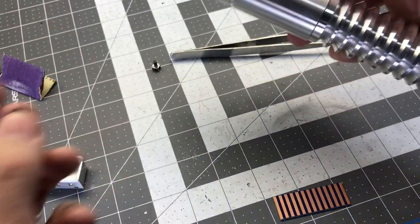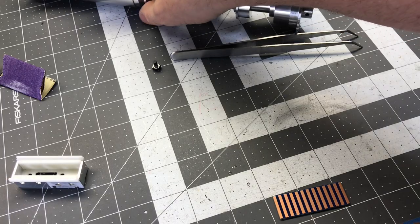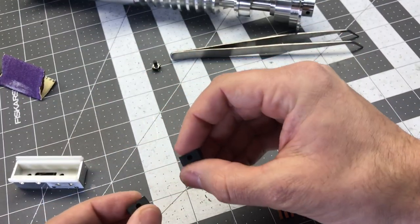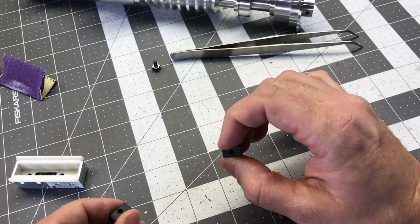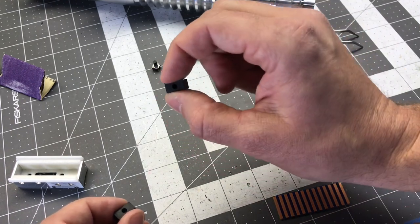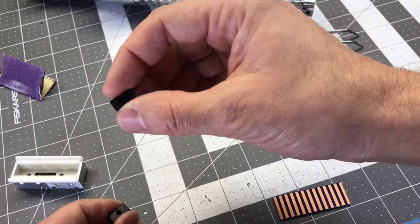There's really no modification — you just glue it on there and it works. These are basically Delrin, also called POM, which is a generic name for what Delrin is. So this very well is Delrin — it's a machinable plastic that can go for high heats and high precision, versus a lot of your standard ABS which wouldn't be able to get the type of finish that this material does.